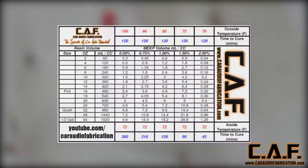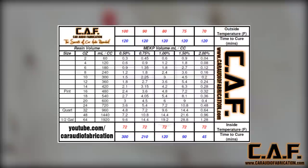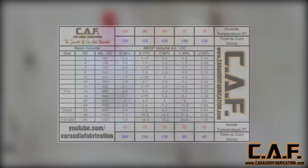I'm going to give you guys a handy tool — as you can see on screen, we have a table. The top of the table shows outside temperature, and the bottom shows inside temperature, so you first need to determine whether you're working outside or inside. On the inside, you can generally regulate temperature to around 72 degrees, then you can see how much MEKP to add for a certain cure time. For example, if you're mixing eight ounces of resin, a one percent ratio is generally best — too much MEKP risks shrinking at too rapid a rate. At one percent by volume for eight ounces, you would put in 2.4 milliliters. Feel free to head to my website via the link in the description to download and print this table.